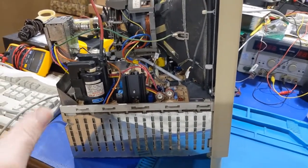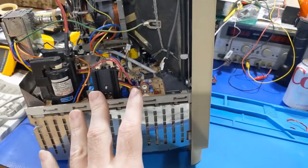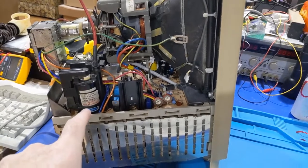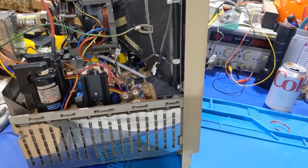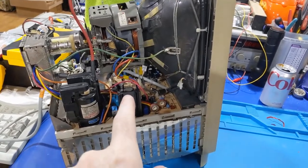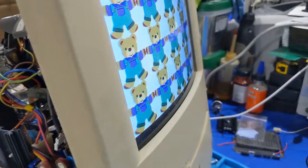But anyway, the flyback off of my parts board that was originally in this machine, but I bought another board, that's a different story. The original flyback that I took off the other board and put in this one works fine. So the issue as of this moment is a bad flyback transformer. Now, the LC550 transformer does not work in here, but I bet it would if I reduce the B plus that drives the machine. I bet it would. So here we are.